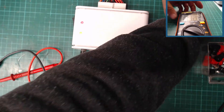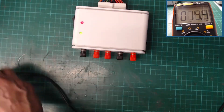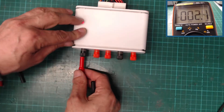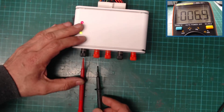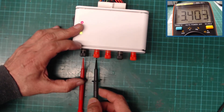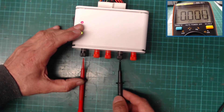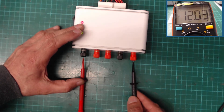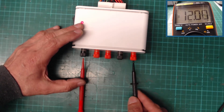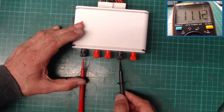Voltage DC. Let's put that under there. So what we'll do is, I'm going to plug one into the negative, and then go onto the 3 volts. Here you can see 3.4 volts. Going into the 5 volts, you get 5.2 volts there. That's negative 12 — or have I labeled that wrong? It's 11.11 DC. Yeah, that's the negative one, so I've basically got them the wrong way around. That's 12 there and this is the positive 12. And that's the negative 12.